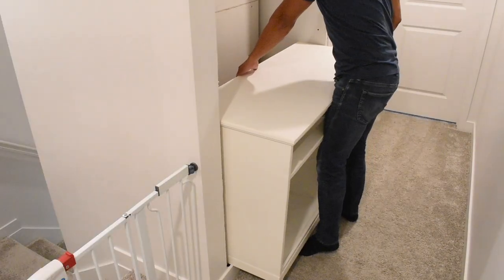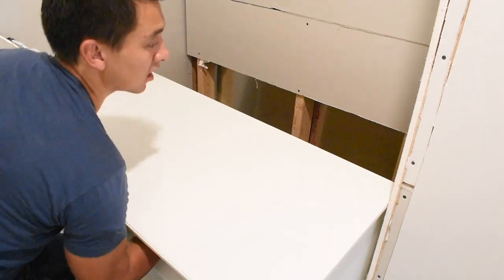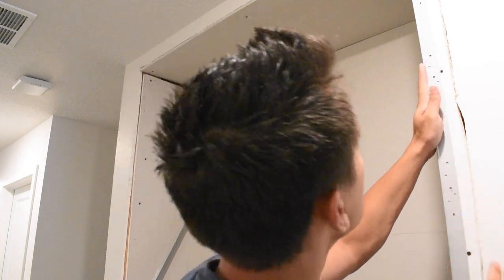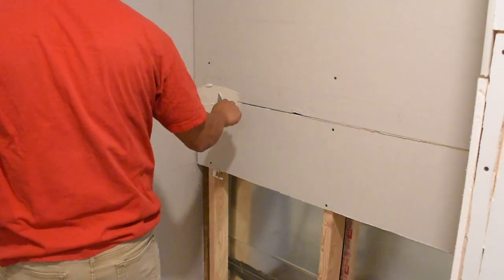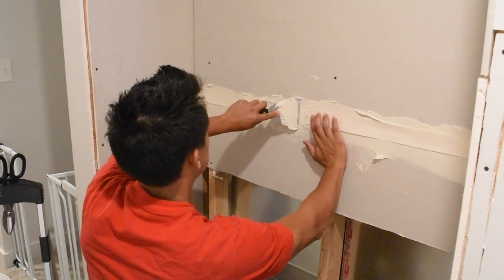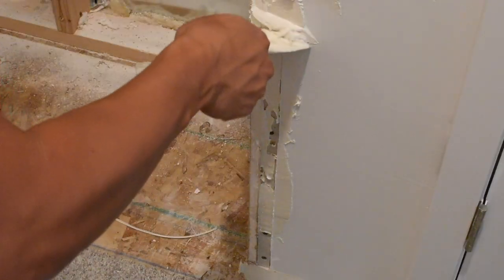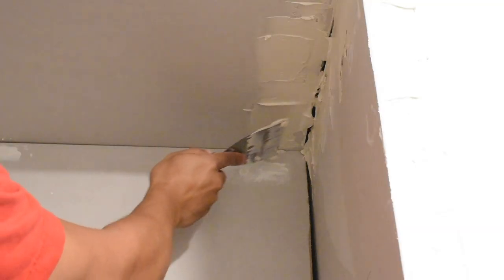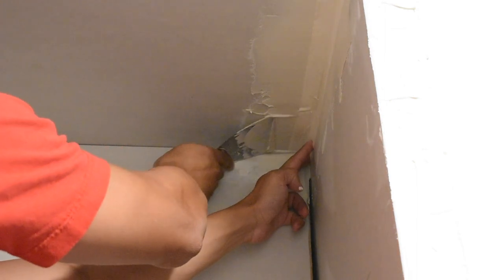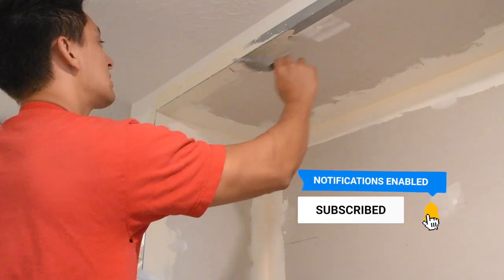I needed to test how the IKEA cabinet would fit. The baseboard got in the way, so I removed it, but the shelf still wasn't flush with the wall. I cut just enough sheetrock out from the bottom so the shelf would fit, and it worked. I got some metal corner beads, measured the length needed, cut them, and did both sides. For mudding, I pre-cut the tape I needed — I like to use paper tape. Put some mud down on the crack, lay the tape, then take your mud knife and flatten the tape to the sheetrock as flush as possible. Cover any blemishes with excess mud, and do the same with the corners.